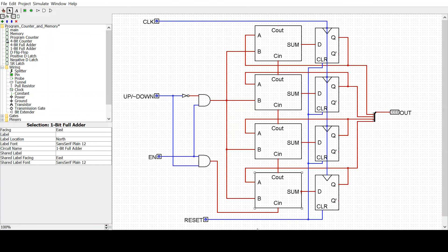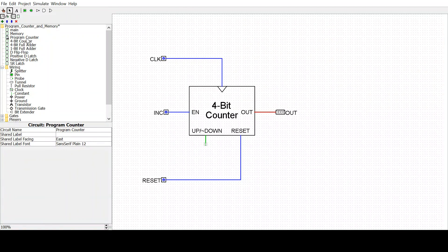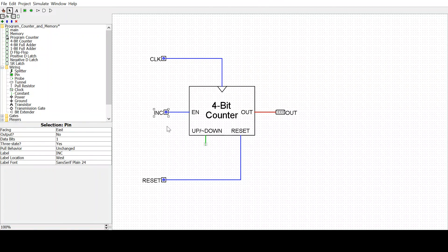Of course, we can reset if we want, and everything works on the clock pulse because these are all registers. That's how the 4-bit counter works. In my program counter, I just make it always count up, because the program counter only needs to count up. That's what the constant 1 input does, and the increment input to the program counter gets tied to the enable input. This only counts on a clock pulse when this increment input is high. That's how we increment the program counter — we only make this increment high when we want to increment, and then on the next clock pulse it will count.